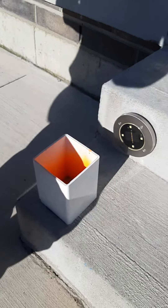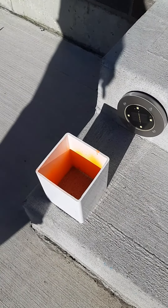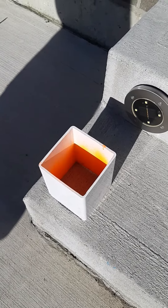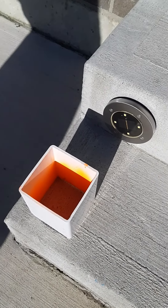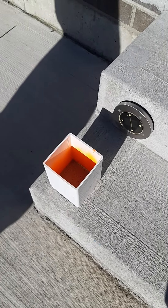We'll square the post to the concrete and go around and lay all of those out. Then we'll mark the inside corners — like we've done before — with a little shot of upside-down orange paint or a Sharpie, just to indicate the inside corners of those posts so that we know where to drill the holes.